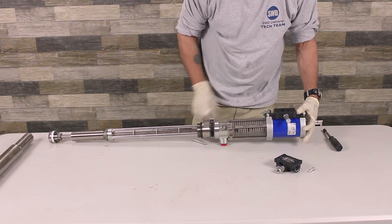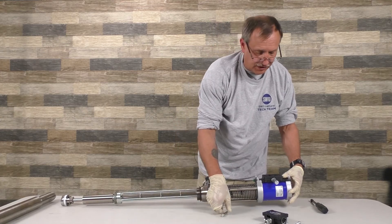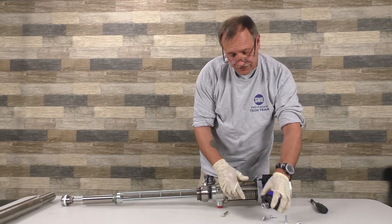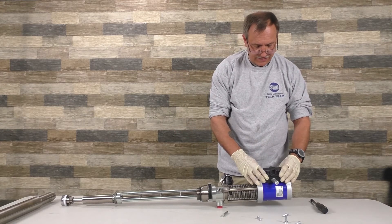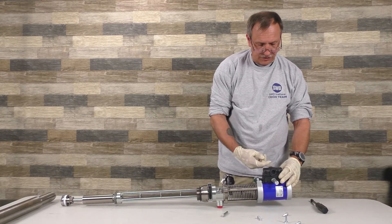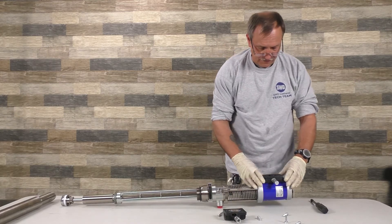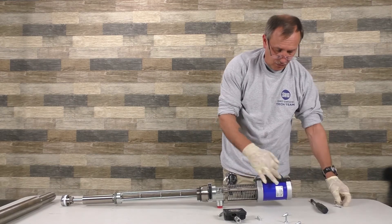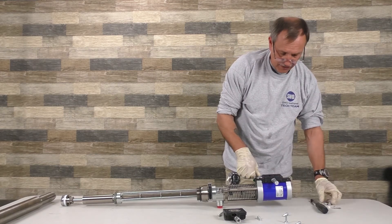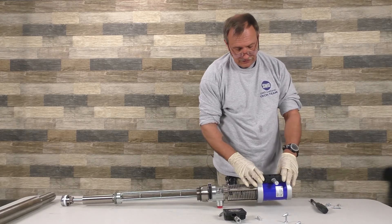The main difference from the T1s to the T3s is the T3 has a spring actuator right here that sits on top. What the spring does is it builds up pressure and pops it back and forth, redirecting the air down into your actual cylinders to tell them to go up and down. This uses less air pressure than the normal one.